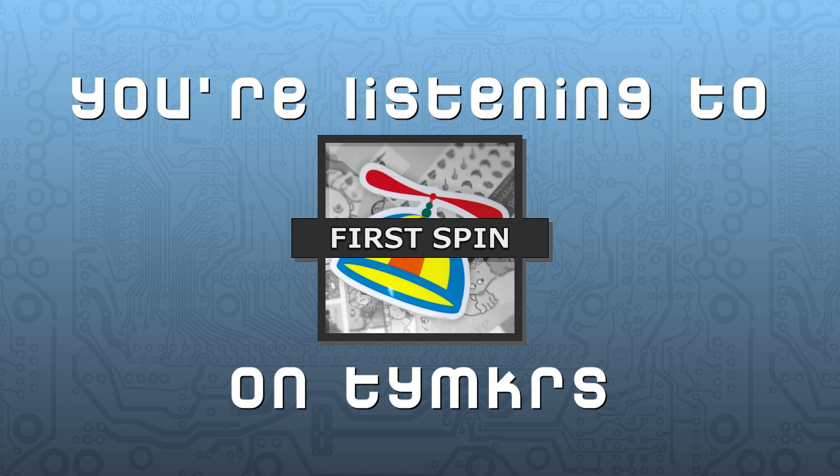The real-time clock is a separate chip with its own crystal running at its own update rate. CLKFREQ and XIN are just for the Propeller processor performance settings — independent of the RTC. The real-time clock tracks actual time of day, like 1:34 PM, and usually includes the date and day of the week. They're typically set up with a battery so when you power off and back on, it still knows the time.